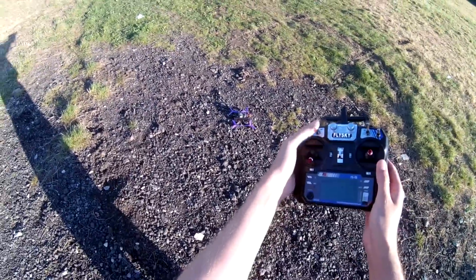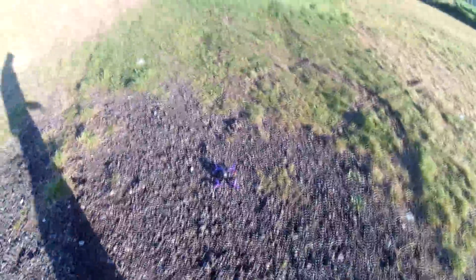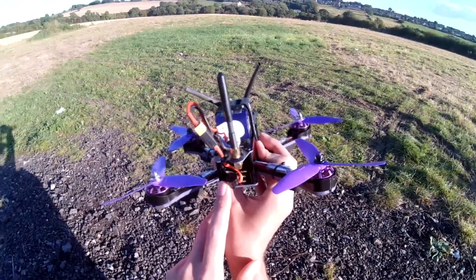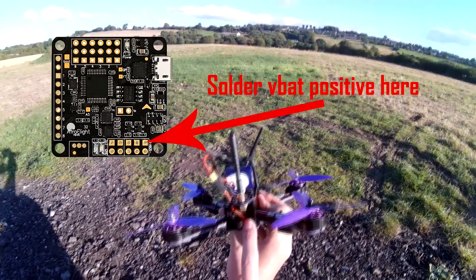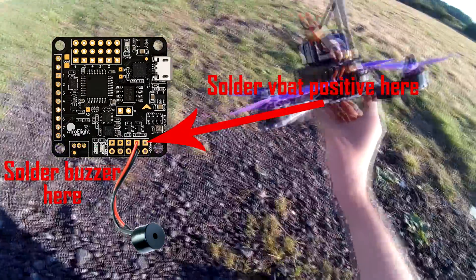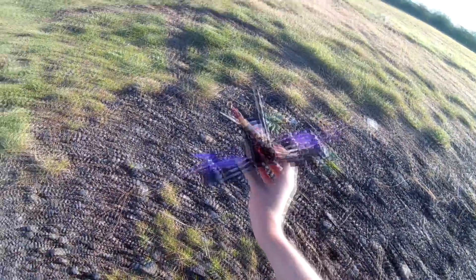Nice, really nice - can't wait to play some FPV with it, but I think I'm going to change that camera out. I've also got a beeper on there as well. There's a soldered wire from the positive where my LiPo inputs into the board to the VBAT on the board, and then the buzzer's just soldered onto the two buzzer pads - it's that simple. I activate it and put it on AUX2, so I've got it over here, and that's it.